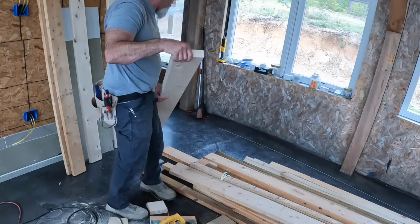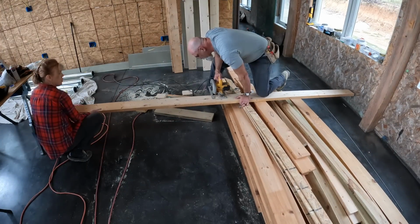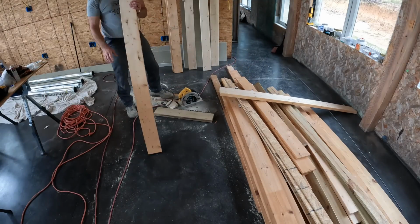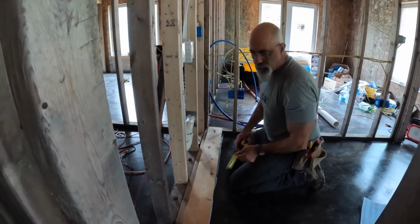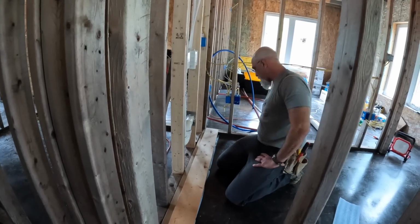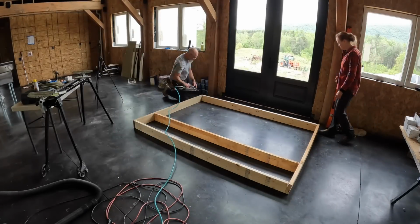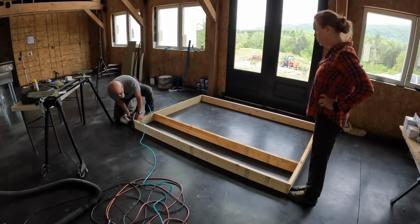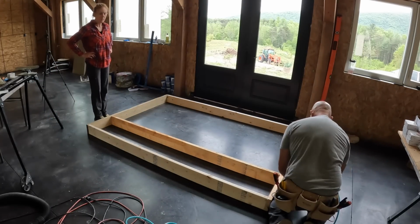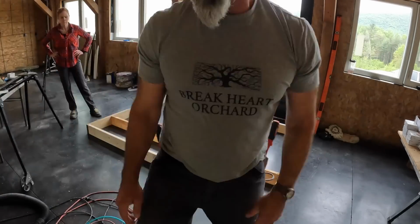I have put together a list of the things that I need to get done before we can get the framing inspection and get drywall put up. One of the things that I've been working over in my mind is how I would get the dryer vent ducting installed. It's 4 inches round, and I have 2x4 walls. They make special compact vents that fit in the wall, and often people will ovalize the pipe to make it fit. But that would involve cutting through the top plate on a load-bearing wall, and I wasn't at all interested in doing that. So finally, I decided to make a false wall in the adjoining closet to give me plenty of room for the ductwork.